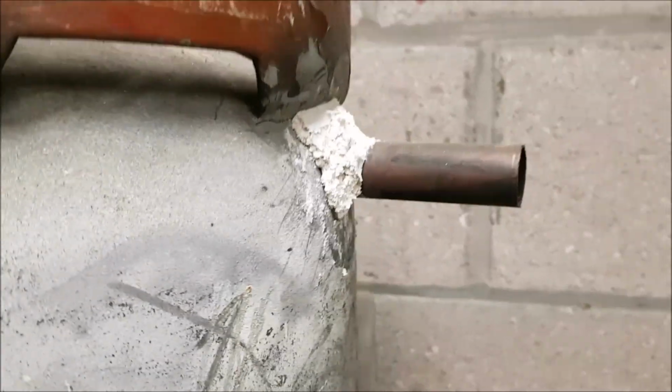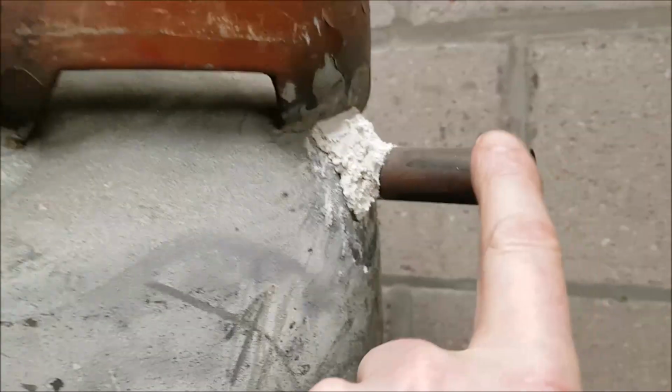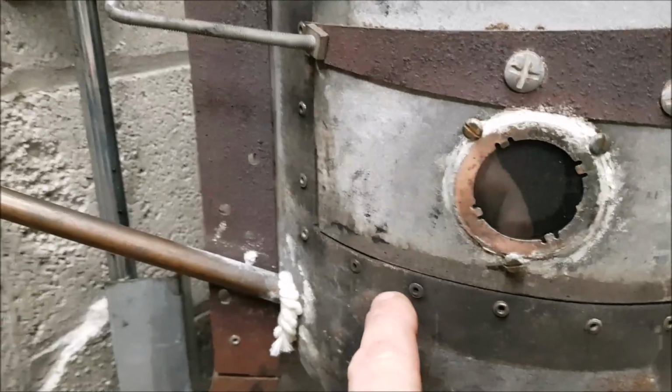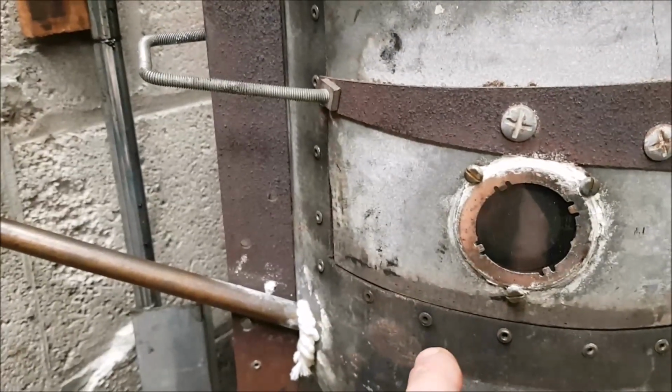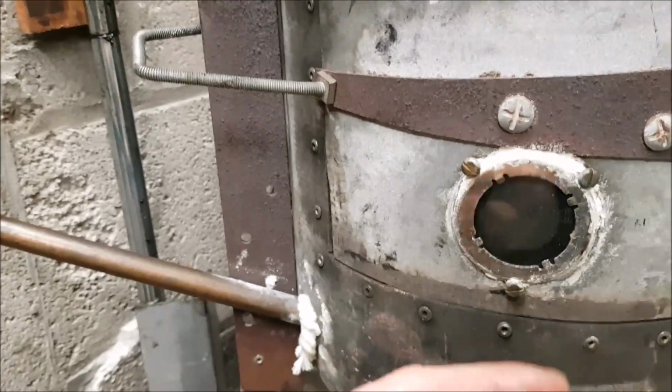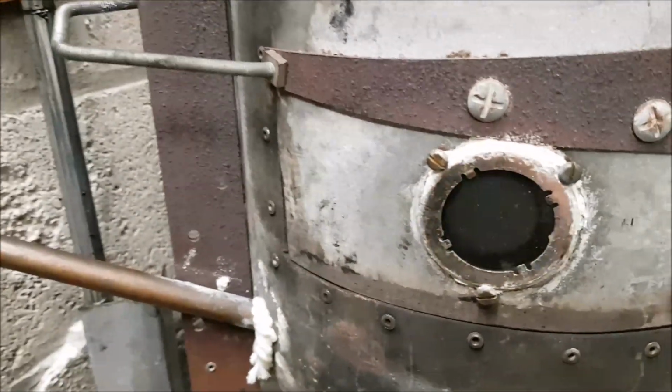When I mentioned this secondary burn system, the air comes in here, cold air gets pulled in here, it goes along the top of the bottle, and it comes down, and it goes just above the main burner. Now, any unburned gases coming from the oil gets recombusted. Well, it helps anyway, just to give it a more efficient burn.